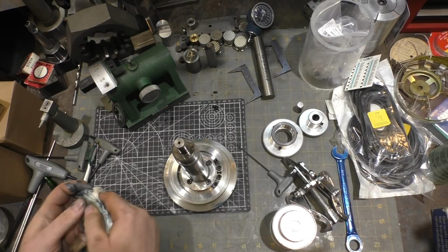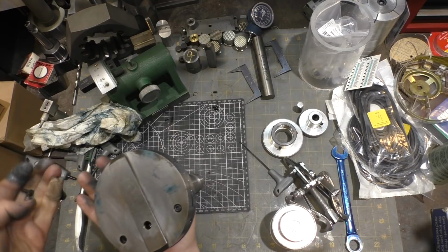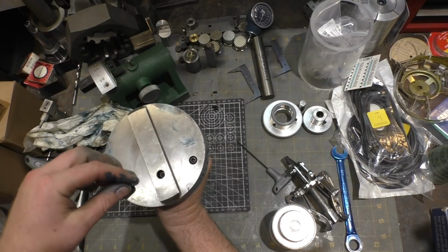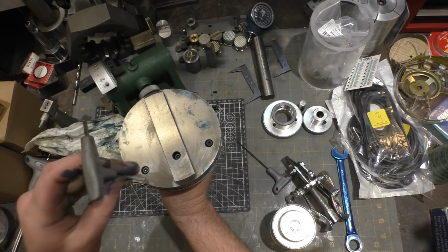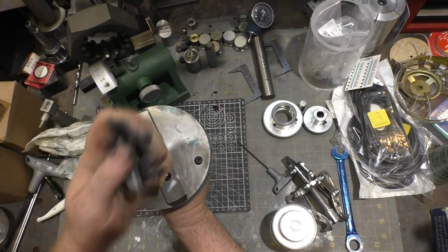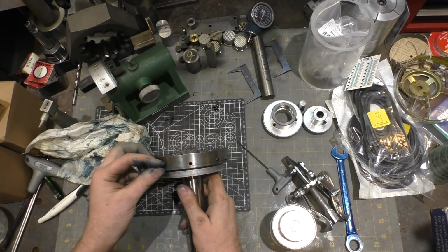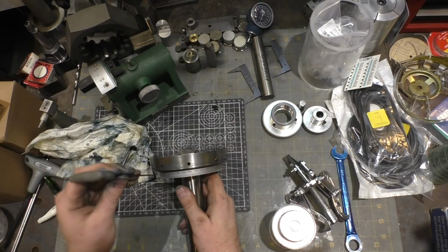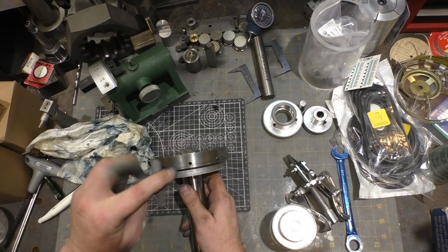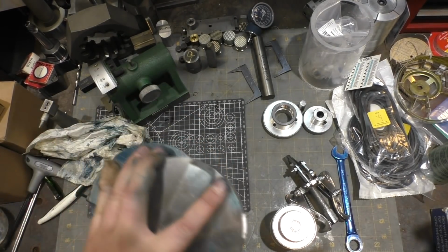All right, let's get the grit off of there. See if we can get these guys just loosely started in the gib. And then we can pop in the set screws. There's two. So now this guy can slide very nicely.